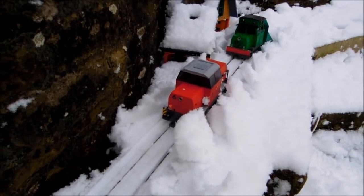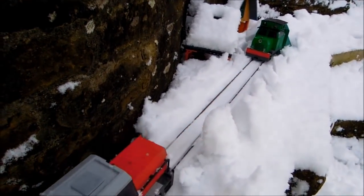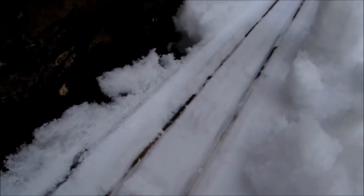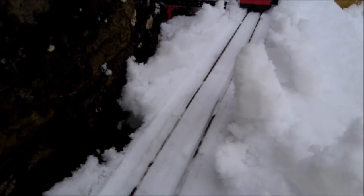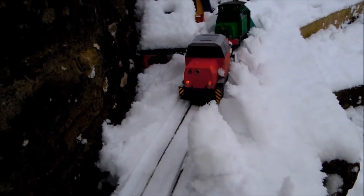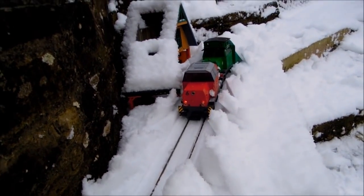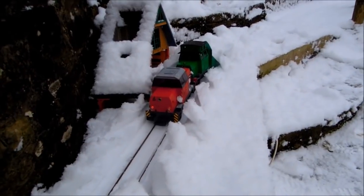Let's have a look. That will go forwards. If I pull this one back you'll see it wobbling. And the reason it's wobbling is because, instead of being ploughed, there are patches of the track where it's just compacted snow. The trick is the plough needs to be really down close to the track in order to actually clear the snow from the rail head rather than compress it.